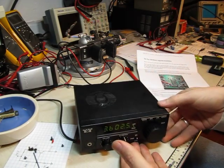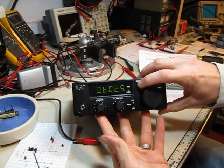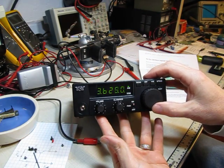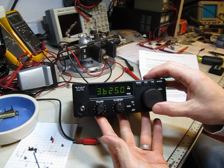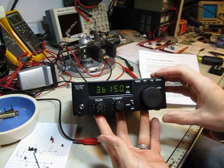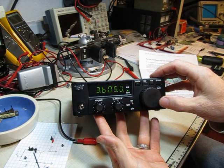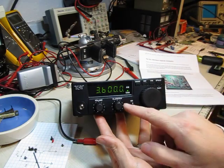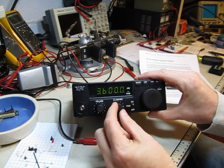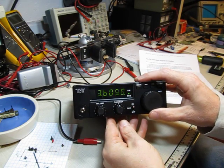The original microprocessor is kind of limited in some areas. For example, in AM mode it tunes in five kilohertz steps, which is okay for AM, but in single sideband and CW mode it only tunes in two-and-a-half kilohertz steps — that's the finest it'll go. You have to use the clarifier control to span anything in between those two-and-a-half kilohertz steps.